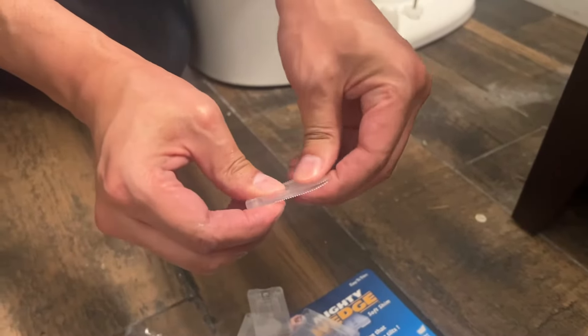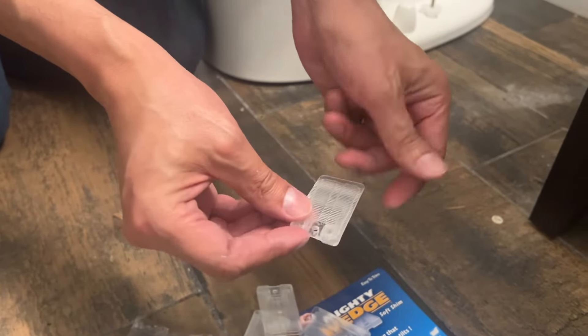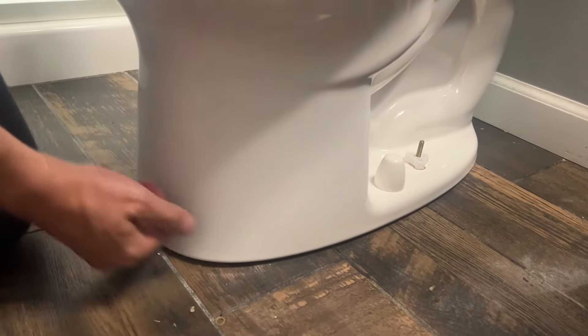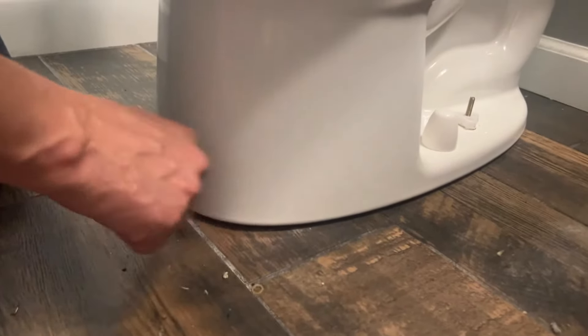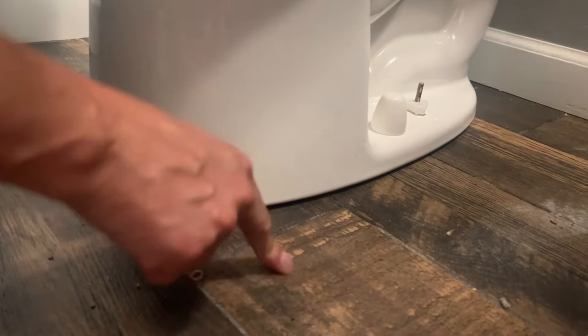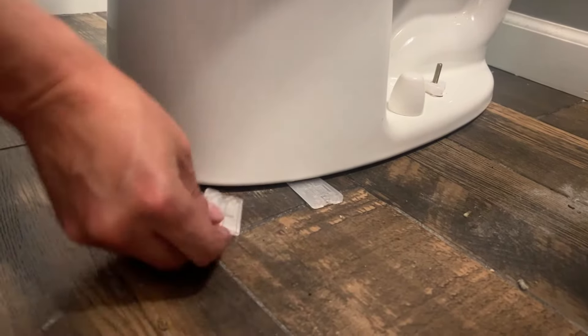This one is particularly soft and flexible, which is kind of nice — just rigid enough to take that wobble out. It also has grooves. You don't have to attach it to the subfloor; you're just going to tap them in and let it do its job. This toilet is rocking from front to back, so I want to fill in this low spot in the front. I know there's concrete under here, so there's no soft spot in the wood, but the porcelain tile must have a low spot in the front. So we're going to take a couple of shims.